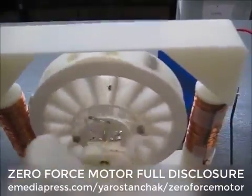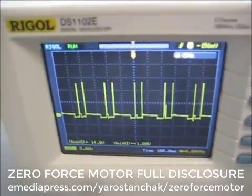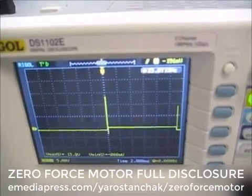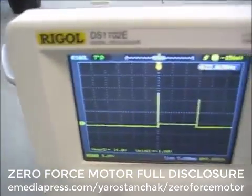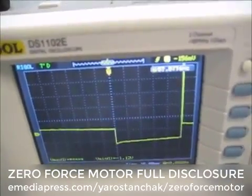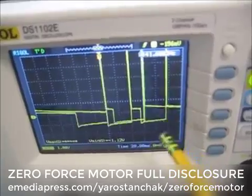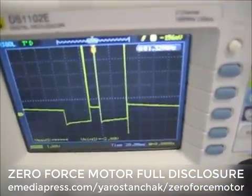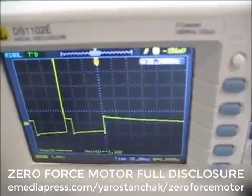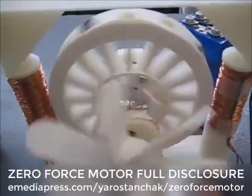Let's look at the wave and you can see what the difference is here. In this signal you see no AC generation at all. This is incapable of generating any power back. What does that tell us? It doesn't have a counter-EMF while it's rotating, which means it's just free in that magnetic field.